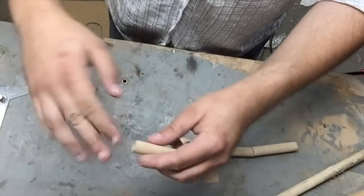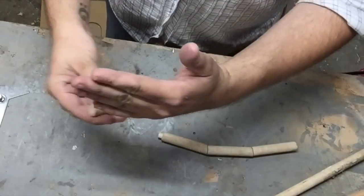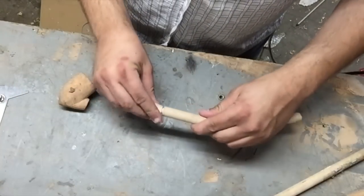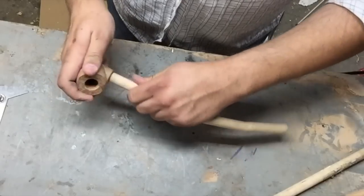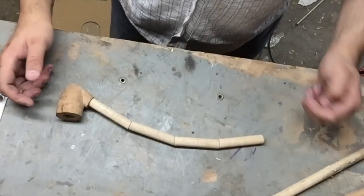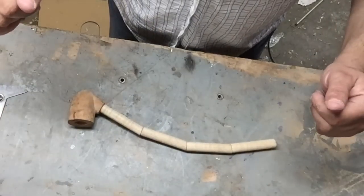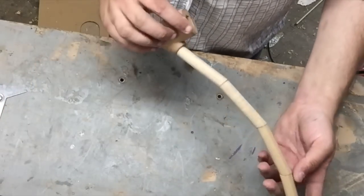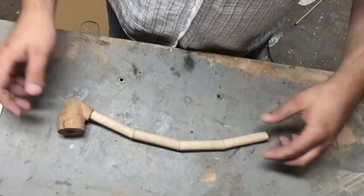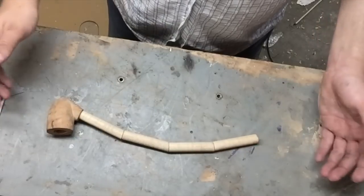So this surface and that surface are perfectly perpendicular, and they're at just about an eleven-degree angle to the shaft, so that when they're placed together, I don't have to curve it. Right now it looks like bamboo. It's been a lot of fun trying to fit these and get them just so. I think this may be the level of perfection I need to accept, and then we'll go into the sanding phase — smooth it all out and make it look a lot less like bamboo.